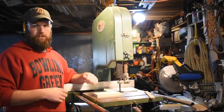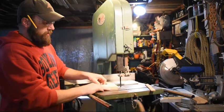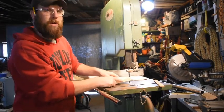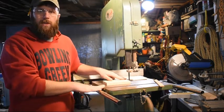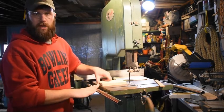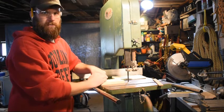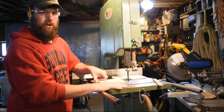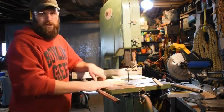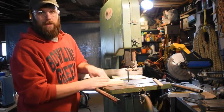It's important to understand how the machine functions to understand the next couple of safety rules. As you're cutting, your piece must be nice and flat against the table. Because the blade is moving in a downward motion, if your piece were elevated when it contacted the blade, it would push the piece down against the table and often pinch your fingers or other objects below it. Also, because the blade is under tension, if it were to break, there is a slight chance the blade could be thrown out of the machine to either side. So make sure you are not standing to the right of the machine while observing.